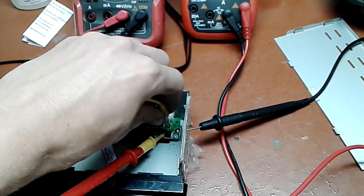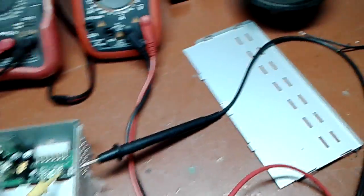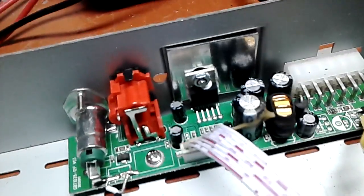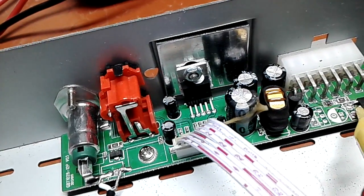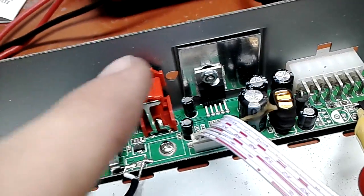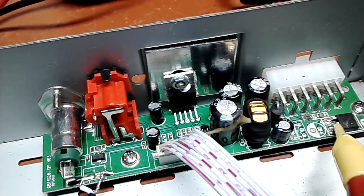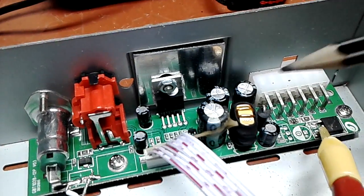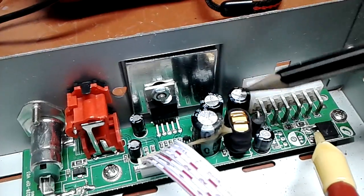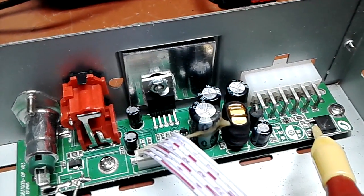What I see straight away, though, is that this is not a true 4-channel amplifier. It has just too small an amount of pins on it. I think it is a stereo amplifier and not a bridged amplifier. Why can I say that? Well, because those two capacitors look suspiciously like output decoupling capacitors. So I think that's what they are.